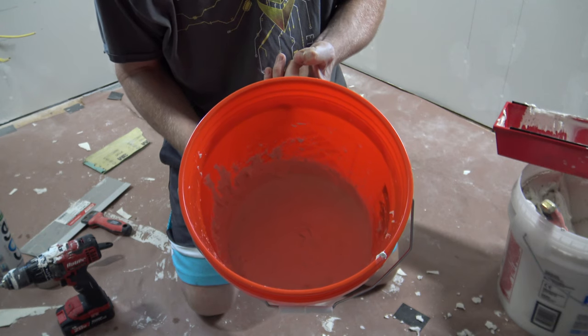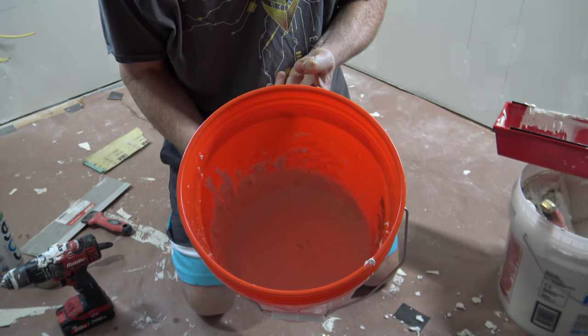Once you've got that mixed up, it's time to apply your tape and mud. That's the easiest formula for how to thin your joint compound: one mud pan full of pre-mix with one cup of water. Mix it up nice and smooth — it's going to apply nice and thin, you're going to have less sanding, and you're probably going to do a better job than if you hire a professional. Hope you guys enjoyed this video, thanks for watching.